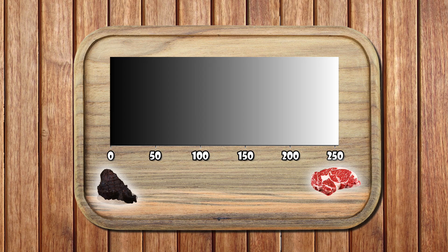The black cap is the burn cap. It sets how dark your darkest pixels are allowed to get. Move the black cap to the right and you're saying: do not let anything get darker than this. Translation for the laser: maximum burn is capped. Push it too far right and shadows lift — you lose punch, like taking the steak off the hottest part too soon.